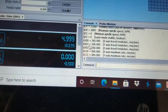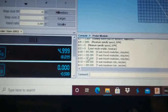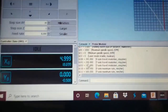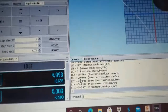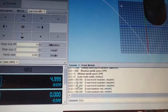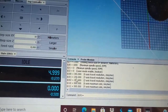All these will be the same because we're using the same pitch thread. So if we wanted to change $101 — that would be Y-axis travel — we'd go $101 equals and put in 395.9.